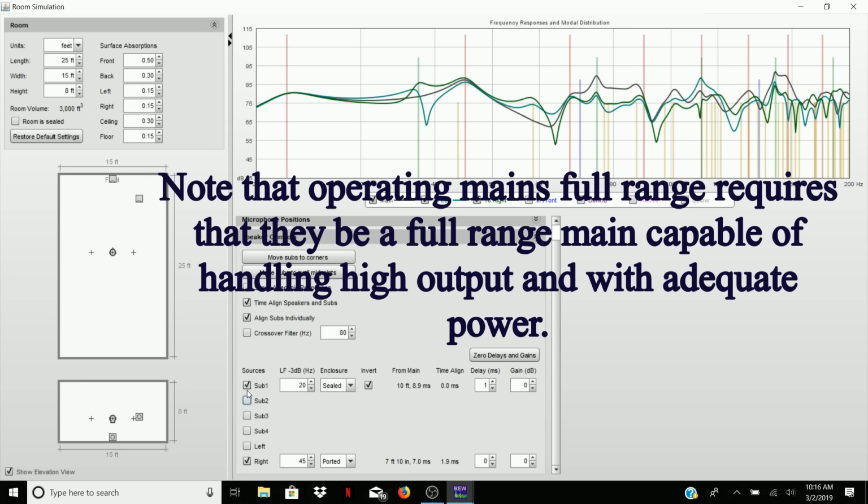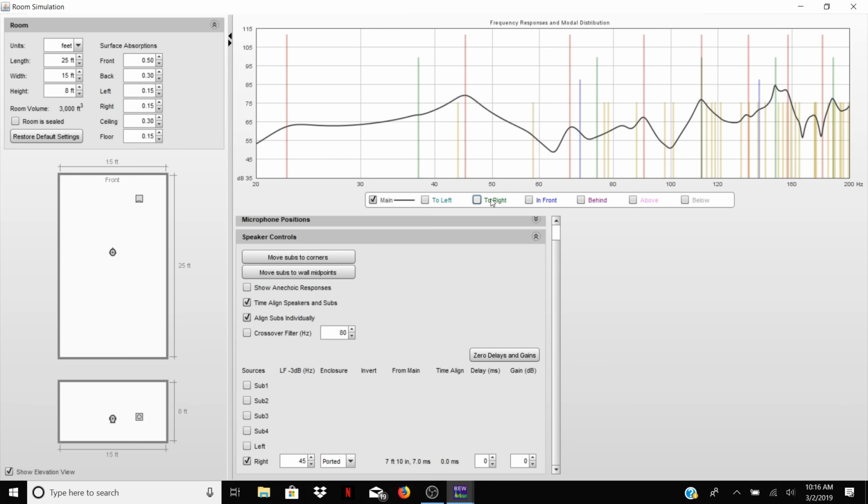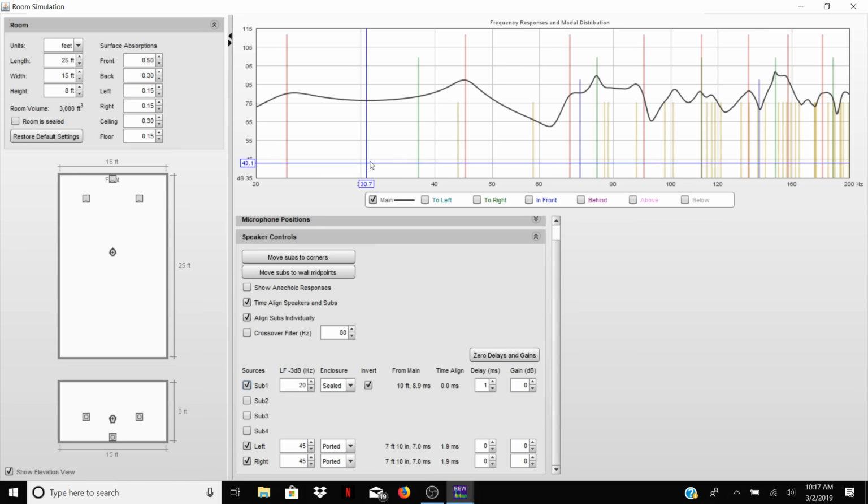By using the main speakers as low frequency sources, they also technically constitute a stereo left and right low frequency source. And so for recordings which do have what might be called stereo bass, it helps to improve spaciousness. So you don't hear that as like a left and a right bass. Below actually about 150 Hertz or so, you don't tend to hear direction of bass all that much, but you do hear what's referred to as spatial variation, spatial differences in the bass position.